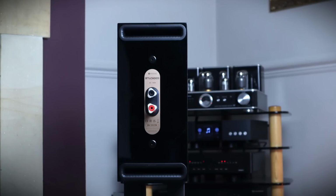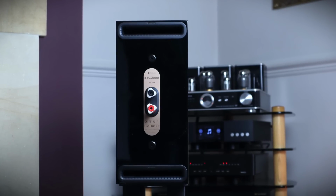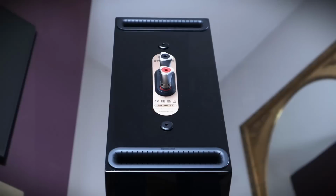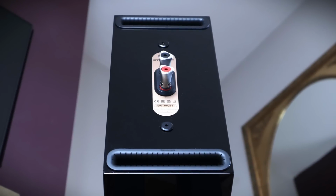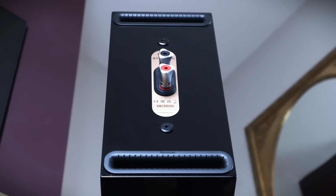Monitor Audio love their acronyms. The two slotted ports are termed Hive, which I suspect is an abbreviation for high velocity. In any case, there are some laminations to the surface to reduce turbulence and port chuffing noises. Mounted to an anodized gold faceplate are one set of very high quality speaker binding posts, chunky and rhodium plated. In fact, they're taken straight out of the 70 grand Hyphen speakers.